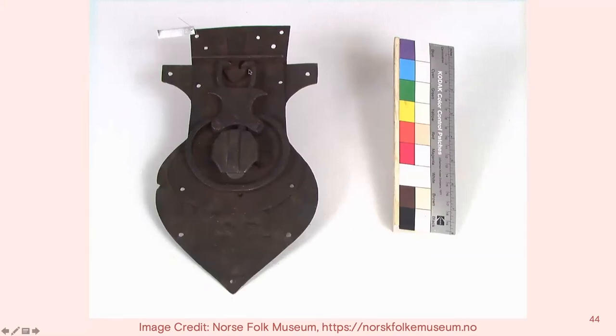The picture shows the keeper in there — you can see the two tabs between the ends of the spring, which is the C-shaped part at the bottom. Those come up and pinch the two grabs together; they're pivoted just below the spring. There's a piece hidden by the plate that the key strikes, hitting one of the tabs just above its pivot point and the other one further above the pivot point, so that piece is made with one end longer than the other to push the two grabs equally apart. As long as both open enough, the lock will work.